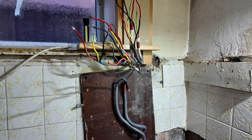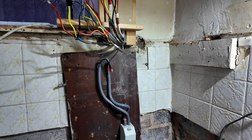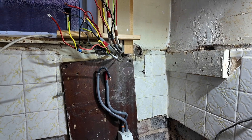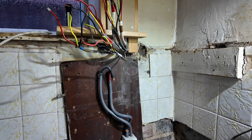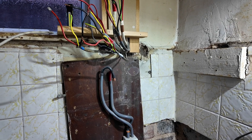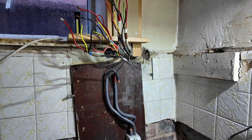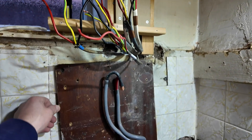Fuse board out, we're going to fix that back a bit. All cables tested and identified — colour coded so we know what's what. Bonding cable, earth cable — this is a TT system and we've tested that side of things as well with just the earth rod connected. Bonding everything taken out — all good. Both rings are fine, which again I'm a little bit surprised about. We haven't got any problems at all at this point, so that's good.